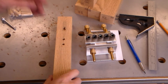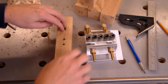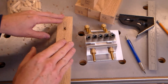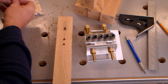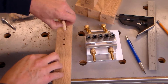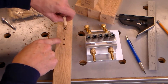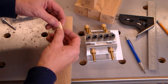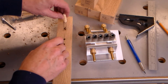After sleeping on it last night, I've decided to make my connections with dowels rather than a mortise and tenon for two reasons: it's going to be easier and I think it's going to be stronger. The tenon would only go in about three quarters of an inch anyway, but with dowels I'll be able to put three in, possibly four — that's a lot more glue surface, and it'll be stronger and faster.